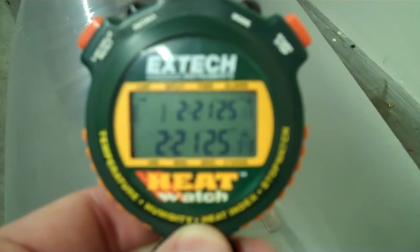We're at 2 hours 21 minutes, and the drying chamber is still going. We've got over 300 CFM coming through the unit here, through the bag, and you can see the water level, still in the 40s on the GPP. It's changed a little bit in the warehouse, so our GPP has gone up just a little bit. Also means we're probably evaporating a little. So we'll keep going and keep track of what's going on here.